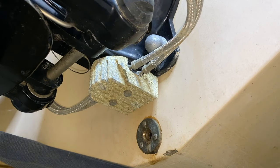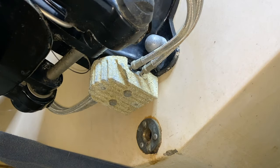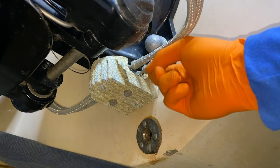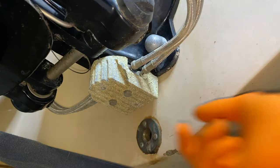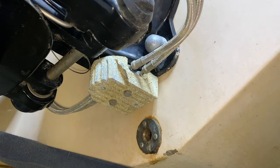DIYers, I now have the camera positioned with a really good view of the bell housing anode. It's on the lower portion of the transom, and your starboard side trim ram hydraulic lines as well as port side feed into the hard-mounted fittings, which are not actually part of the anode itself. So when we remove this anode, you will notice the hydraulic lines don't move, nor will we have to direct any attention to those. However, as you remove and install the new one, do your absolute best not to harm the fittings or the hydraulic lines on either side.